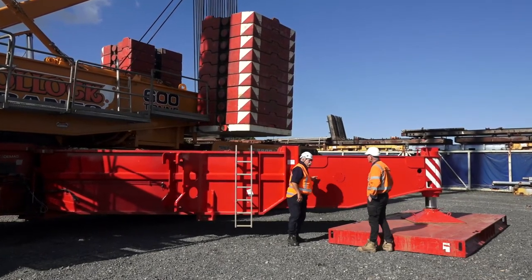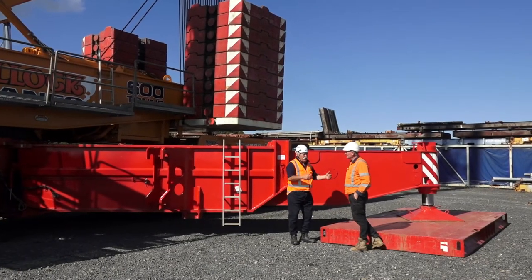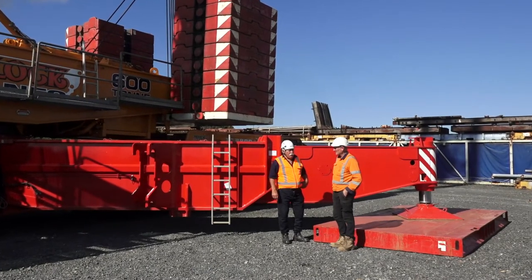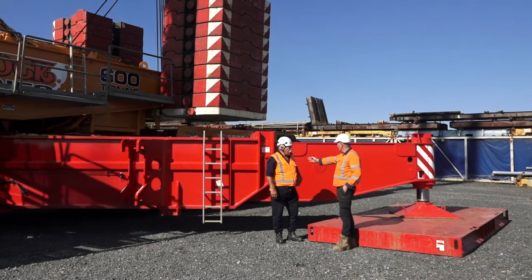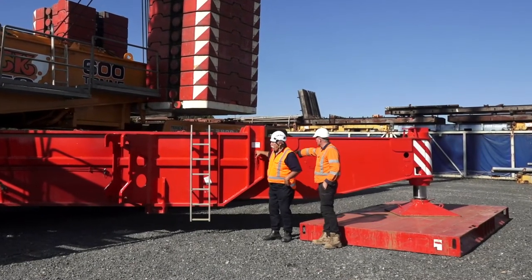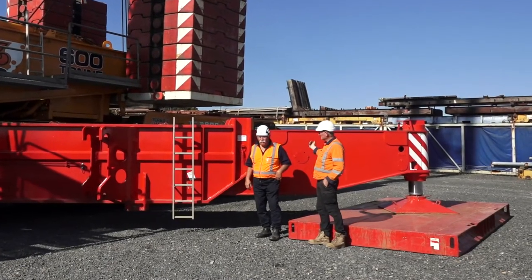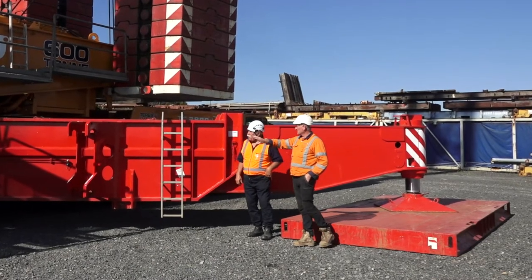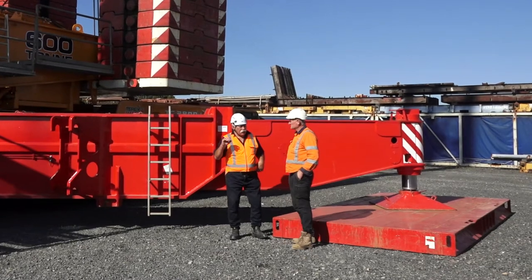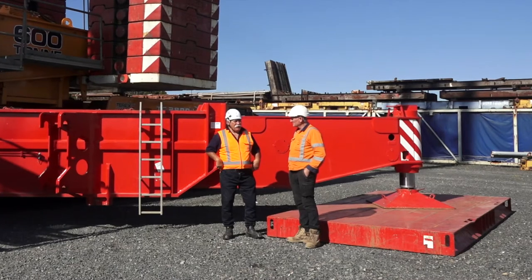How do you cart these around when you move? They don't fold up and go with the carrier - no. Once we pack up, this section here will slide in, and we've got a locking pin behind where we lock them in for transport. It's in the lock position now for working, and when we pull it in, we suck it in. All four legs actually come off the crane for transport. Can you get them on two trucks? Yes, two legs on each truck.